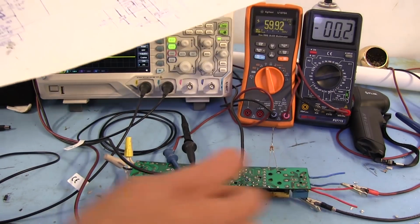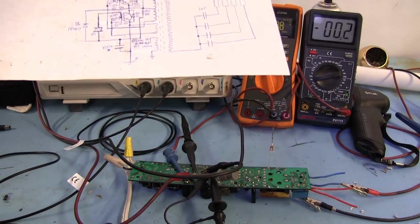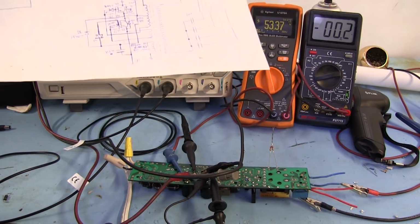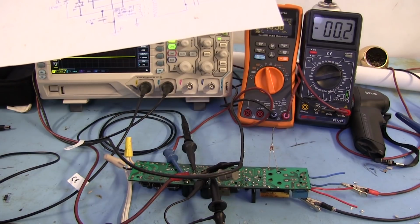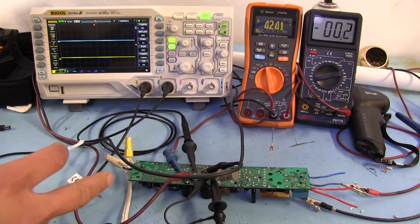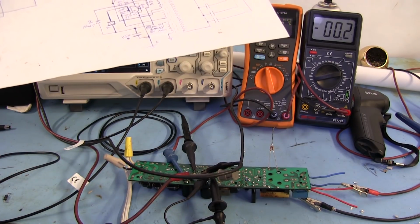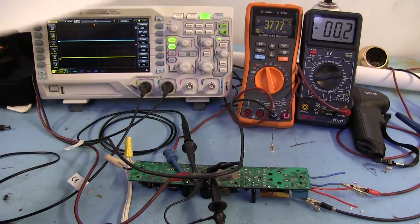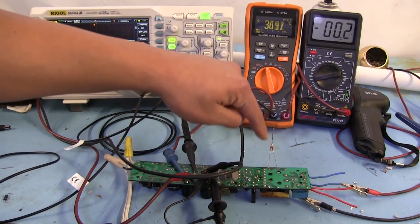Oh yeah, one other little thing. The resistor that was over here, the one that was cracked, had colors of brown, black, black, red, red. If that was the original value of a 5-band resistor, that would have been a 2%, 10K resistor. That seems really odd, especially for part of the circuit that powers the PFC. So I think it most likely was supposed to be red, red, black, black, brown, which would have been a 1% 220 ohm resistor, which makes a lot more sense than having a 10K resistor in that spot right here.